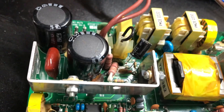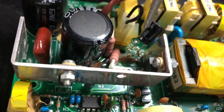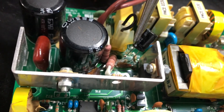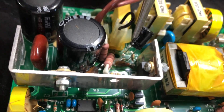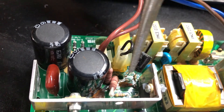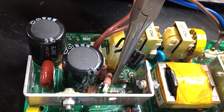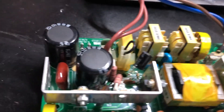I have gone ahead and replaced the capacitor, and I have it elevated off the PCB — it's still connected at the terminals with the correct polarity, but this way it's kind of free-floating in the air, away from the heat source that was causing the problem. I've also moved these two resistors as far away as I can.